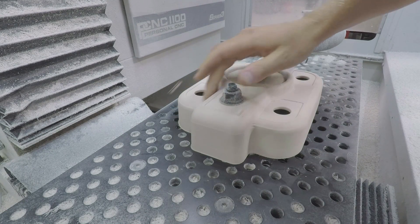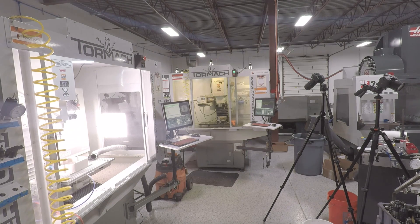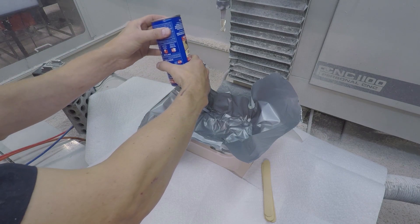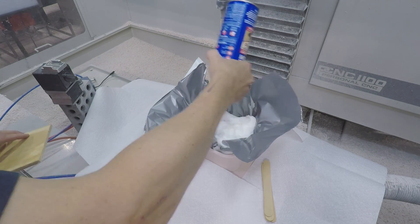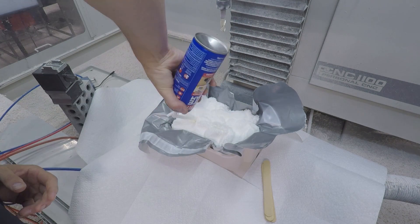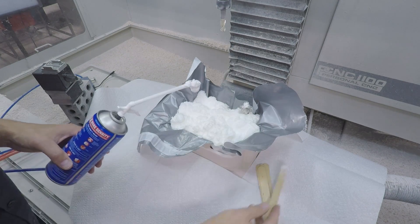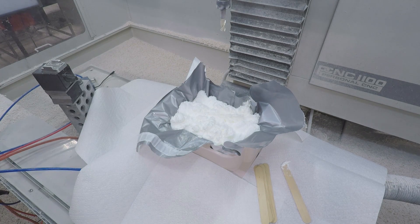What are the takeaways? Better work holding. I had a pretty creative idea — which I still think has potential — of using Great Stuff or one of the expanding foam insulation materials to create this internal cavity. Not only could it provide support, but we put a piece of wood in the middle of it when we poured the stuff, and that would have allowed me to use wood screws to screw from the top or bottom and give me a really stable and structurally supported work holding. My mistake was I needed better plastic covering on the inside or some sort of mold release so it could contour the shape better, and I needed more pressure on the top so when the foam expanded, it expanded into the nooks and crannies rather than just expanding up the top. Lesson learned.